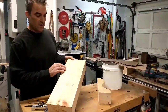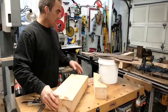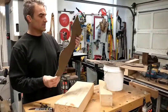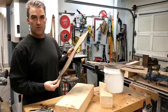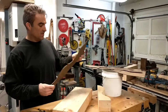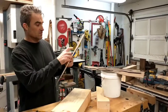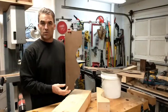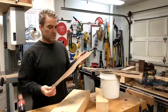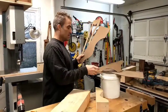I'll begin with a layout of your cut for the actual corbel. I have lots of different patterns that I've made — I make these out of eighth-inch MDF or masonite. It's really cheap wood; you can get a four by eight sheet very inexpensively at Lowe's or Home Depot. I'll use these as my patterns when I find something that I like. You can just sketch it out — I cut these out on a scroll saw. If you don't have a scroll saw, you can use a jigsaw, a very inexpensive tool. These are just some of the patterns I've made over the years.